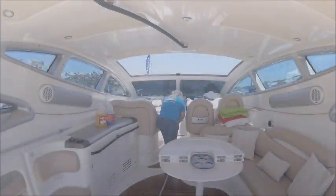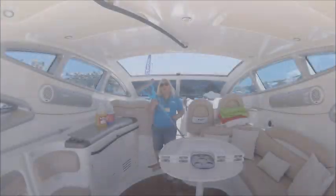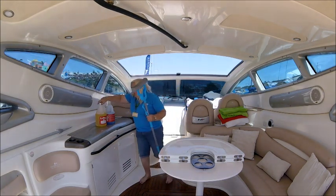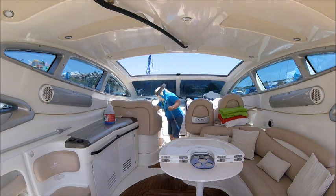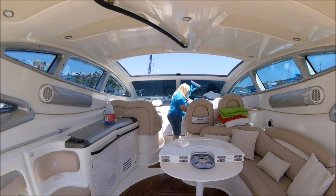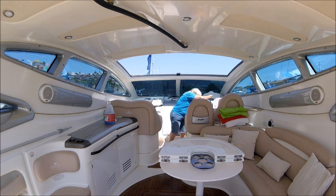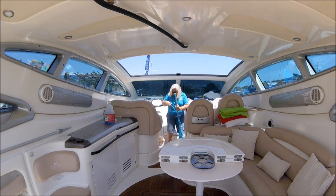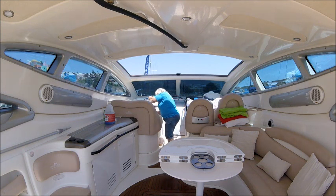Okay, this time we're using one of these little sponge mops, which we'll use to push the brightener about a bit. So, top off the brightener, again, apply it quite liberally, again in stages, working with the grain. This thing works instantly. Once you've done it, it literally just needs to be mopped straight off. Again, spread it about lightly and then give it quite a full mop.